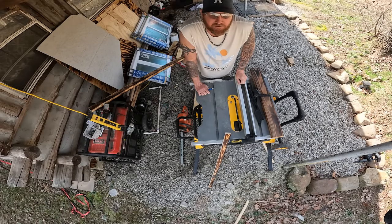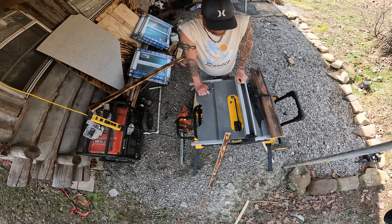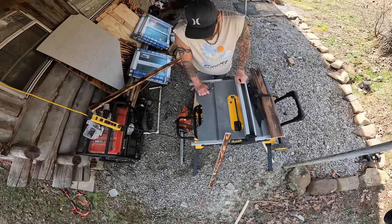So the best way that I have thought of to come up with this and to be able to achieve the look that I'm going for, but yet at the same time still have the stability and strength that I need, I'm gonna rip a couple of 2x4s right in half, just to kind of shrink the profile of them just a little bit, and then notch them into place, which I'll show you all that here in a minute. And that way I can get some good nails in and also get the shelf on there and nailed off securely as well. And then go ahead and do a couple of the shelves and make sure that it's going to work. And if it will, then we'll go ahead and rip the rest that we need.